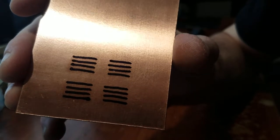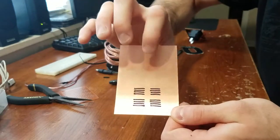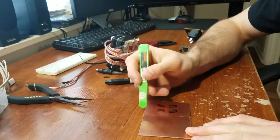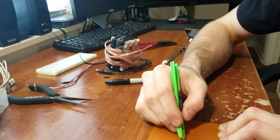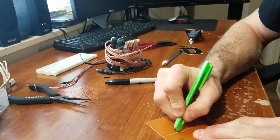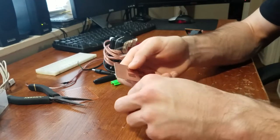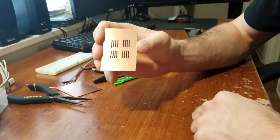Now I know the ends of the Sharpie lines are where all of the holes are going to go. We're going to put this into an acid and it's going to eat away all of the excess copper. But before I do that, I'm going to cut this in half so I can save the other half — there's no reason to waste all that copper. I've marked each side so I have a general idea of where to cut. I'm going to score this so that when I go to break it, it breaks along this line. I'll also score this side — and now it should break just like that. Perfect. I'll save this half for a later project and we're going to go outside and etch these lines into this board.